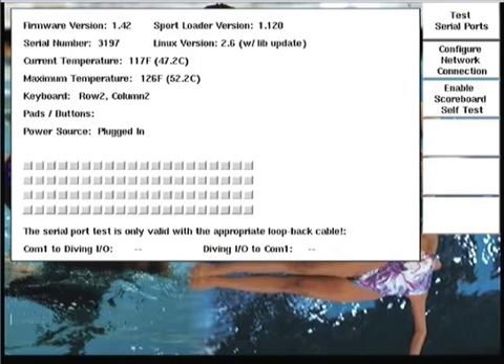Now let's get back to the pads and buttons section. This area shows you what pad or button is being pressed out on the deck, for both the near and far end connections and for up to 12 lanes. This would actually be a really good place to start off your testing before a swim meet. Without any deck equipment hooked up, it tells you basically that the internals of the timer are okay and nothing is shorting out. As you hook up your equipment, you can look at this to make sure that none of the push buttons or touch pads are registering when no one is touching them. I'll hook up one of our training keypads on the near-end connection on the back of the 6. The training keypad helps me simulate a race pad and one button without having to drag out a cable harness. Notice that when I press near-end lane 1 pad it shows on screen, and when I change to the far-end connection, it now shows far-end lane 3 pad.